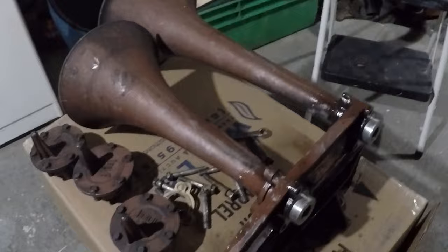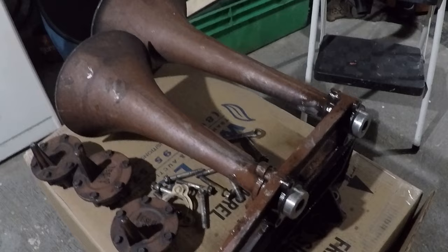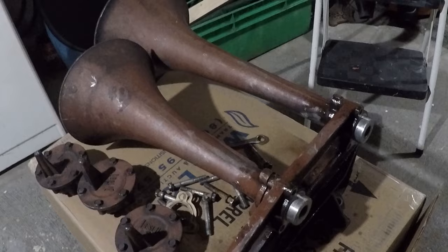I've had horns where the bells have been stuck to the point of, like, oh my god, no return, and I sprayed them, let them sit, sprayed them, let them sit, still couldn't get it. I warmed them up, heated them up, and sprayed it again, let it sit overnight. The heat drew the Deep Creep in, and they tapped right out like nothing.